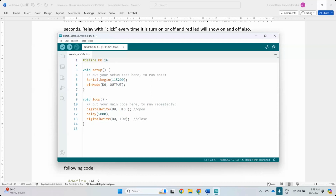This is AMS1117, I believe. Yeah, that's the component number. I do have a lot of these. So this is a very good regulator. It basically can output 300 milliampere. Should be okay. So we have three ports here that allow us to connect components.